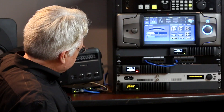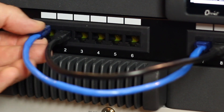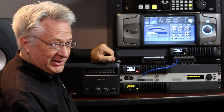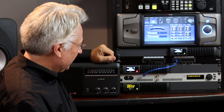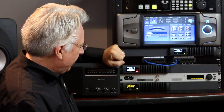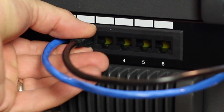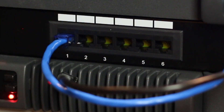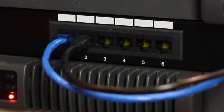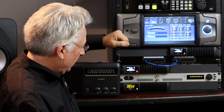Time to do our experiment. Let's bring the radio up here a little bit closer, turn it up, and we're going to unplug one of the networks. And as you'd expect, there's no change because we're just using packets from the secondary network. Now we'll plug the primary network, or NET1, back in, and now we'll go unplug NET2. And as you can hear, no difference at all. It's a packet-by-packet replacement — if you just lose a packet, the MPX decoder node grabs it from the other network.